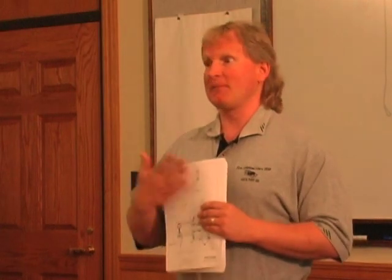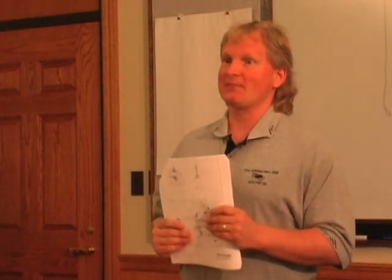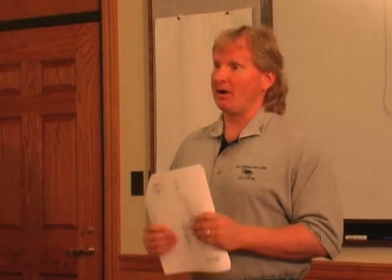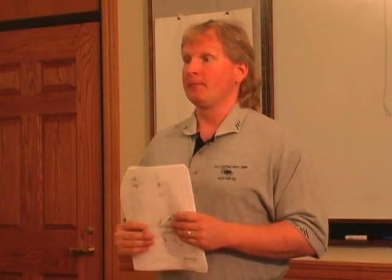That's what your pipe strain is strictly going to come back to. And like I said, I don't know, that's something that time will tell on that type of stuff. However, like I said, on the horizontal pumps, it's easy to tell if you have pipe strain. If your alignment starts going haywire after 6 months, 7 months of service, there's pipe strain issues going on. And like I said, these do get affected a lot by pipe strain.